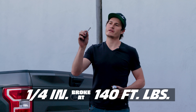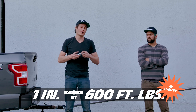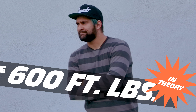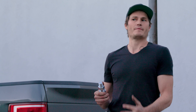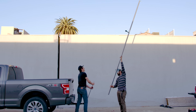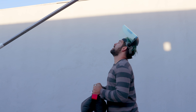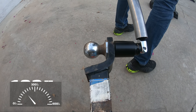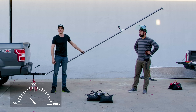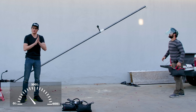We were able to snap a quarter-inch bolt with around 140 foot-pounds of torque. Now this one-inch shank bolt is coarse-thread SAE grade 5, so we're going to put about 600 foot-pounds of torque on it using a breaker bar with a 13-foot stainless steel pole. We'll hang sandbags on the end and see if it can snap. Right now we have 182 foot-pounds of torque factoring in the weight of the 13-foot pole. The first sandbag Joey's going to put on is 35 pounds, and we're going to keep adding bags from there to see what happens.